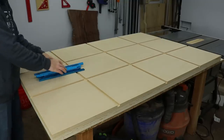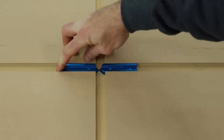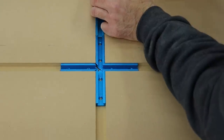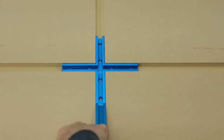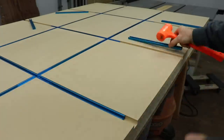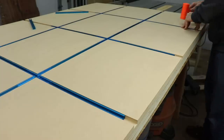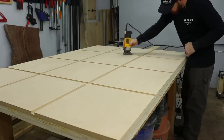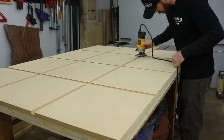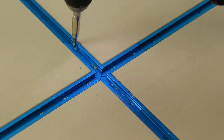Then I turned my attention back to the top and started laying in all the T-Track. Off camera I already pre-cut everything to fit, so now I just need to get it all put in. Rockler offers this T-Track in all kinds of different lengths and they also offer these intersections — they come in four pieces and just slide right in, which is a lot easier than trying to cut them yourself. The spots I'm leaving at the end are so I can slide clamps in. I test fitted all the T-Track to make sure it all fits, then pulled it back out and ran a small roundover on all the edges so there are no sharp edges sticking up. Once done I installed all the T-Track using a self-centering bit to get all the holes in the right spot.